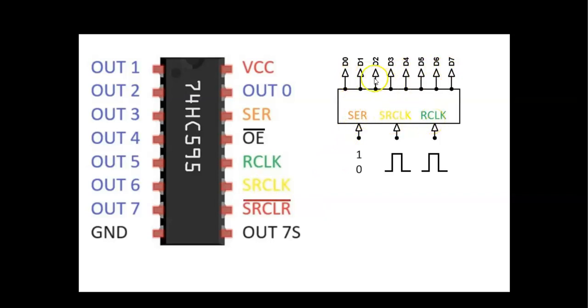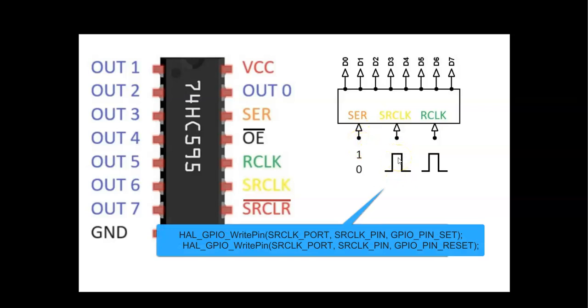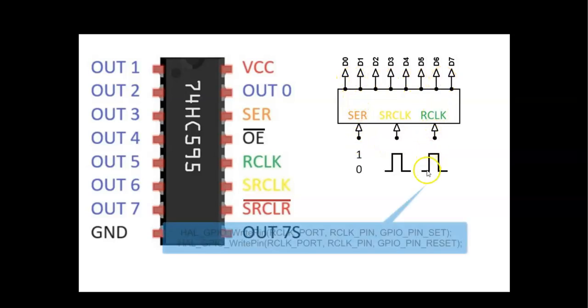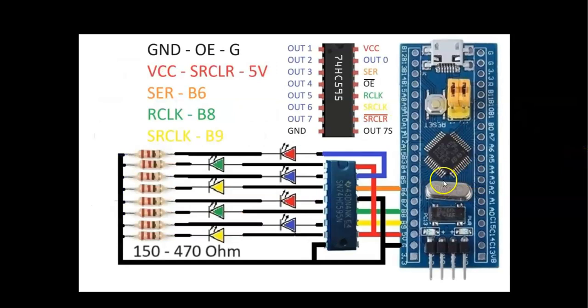From these 3 inputs we get the output. How it works: when we have any value and we put this clock signal high then low, the value shifts — this value goes here, this one goes here, and so on down the line. On the next clock it shifts again. So when you put the data and shift it with this clock eight times, eight bits of data come in. Then when you pulse the RCLK, all the data pushes in and locks.